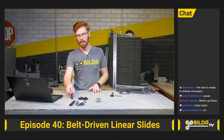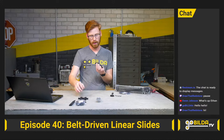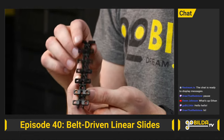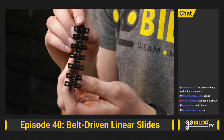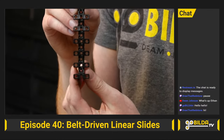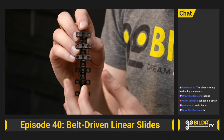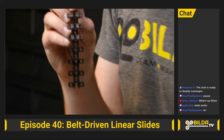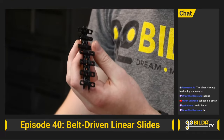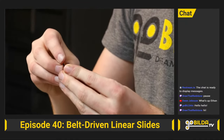We also released, in the theme of intakes, grid chain. This is a really great addition that makes our plastic chain ecosystem even stronger. Here I have some grid chain linked with a piece of standard plastic chain to space out those grid sections a bit more. These are great for intakes and moving things around your robot — you can bolt whatever component you want to these 4mm holes. You can have them linked together for a really compact pattern, or intersperse them with standard plastic chain.